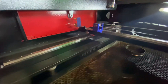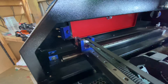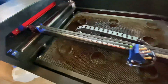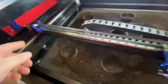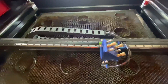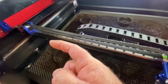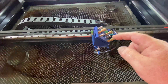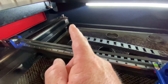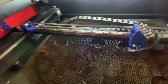When mirror two was all the way at the front of the machine, the beam wasn't even hitting on that mirror at all — that's how far I'd thrown the alignment out. During that same process, I'd also started messing around with the set screws on the back of the laser head, because I thought those screws helped align the beam coming off mirror two to mirror three. Again, it does not. Those set screws actually align the beam going straight down to the bed or to the material.